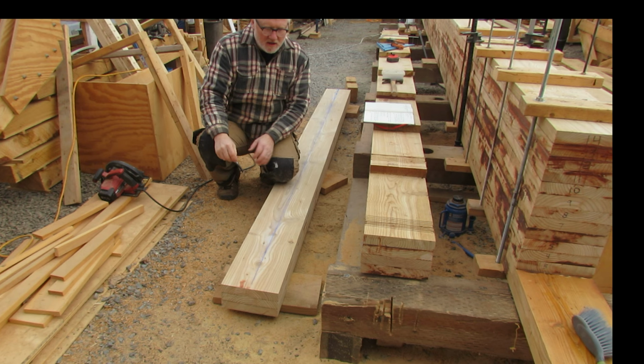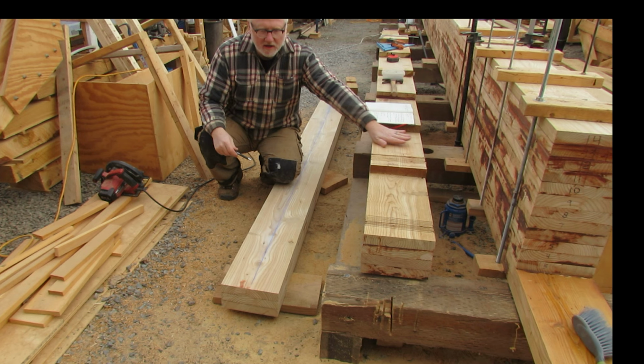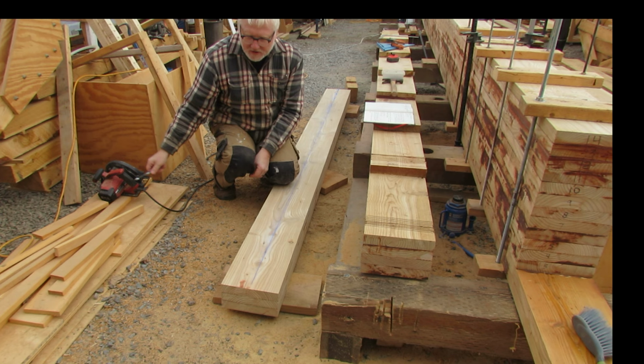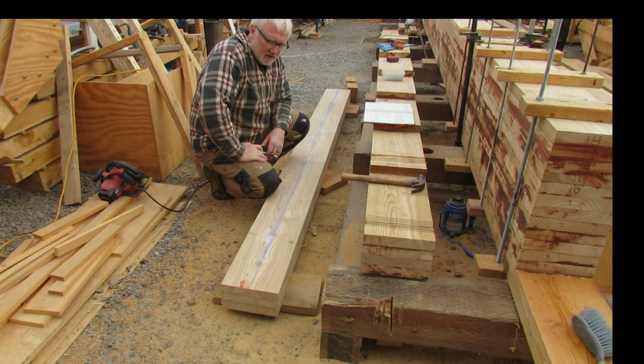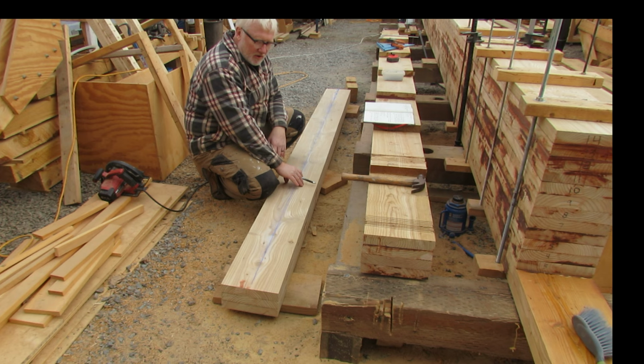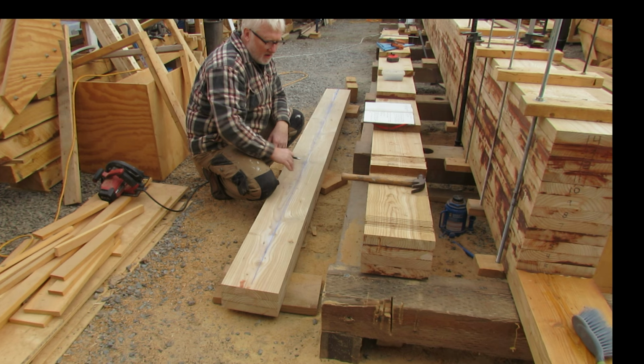And then, because half the shaft alley is going to be here, half is going to be on the other piece, I'll go half the depth on this piece. So I'll go 1⅜ depth, and then I'll just use my circular saw, which should give me a fairly flat, smooth interior that's been hogged out. Now I'll need a little bit of touch up, and then I'll put two or three coats of epoxy on the inside, because once glued on top of each other, there's no getting back inside here. So again, 1⅜ either side.